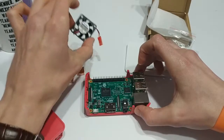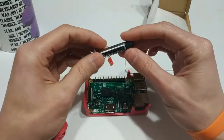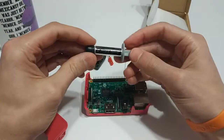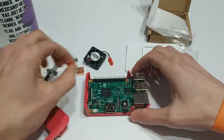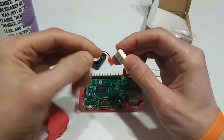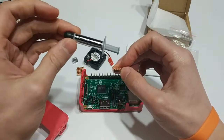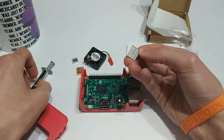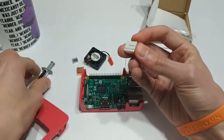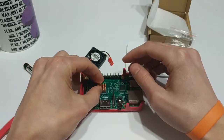You've got some cool passive cooling options and a fan. Now, you're probably wondering what this is — this is a tube of what they call thermal grease or thermal paste. This is Arctic Silver 5. I had this left over from a previous PC build — it's a 3.5 gram little tube. I'm going to use it to essentially fix my heat sinks. These guys have some thermal tape on them. The thermal tape helps pull heat away from the chip into the heat sink so it can dissipate into the air. Thermal paste does a way better job than the tape. So I'm going to take that tape off, scrub it down with some isopropyl alcohol so it's nice and clean, and then shoot a tiny little dollop right in the center of that chip, then push this guy down.